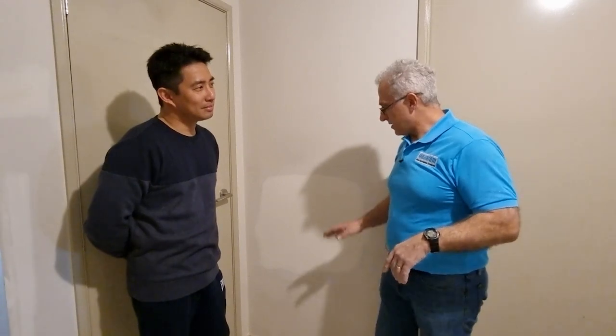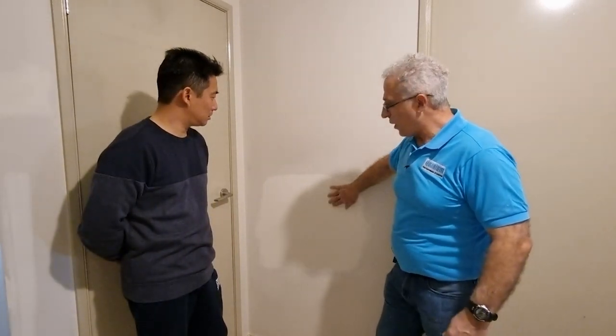One thing I didn't do on video — I didn't put a mask on. This was only a very small area to sand, but be very careful if you are sanding a large volume of top coat — it's not good to breathe this in. One of the biggest killers in the building trade is silicosis, and anything with masonry or powders, if you inhale them, will damage your lungs. This was the first time I've used Siniat top coat and I was really impressed — it dried well, sanded easily. I'd like to thank the guys from Plaster Master for their advice over the years. I'll put links below for Plaster Master and Siniat. That's the end of the video — please leave comments below, subscribe, hit the like button, and share the video. See you guys!